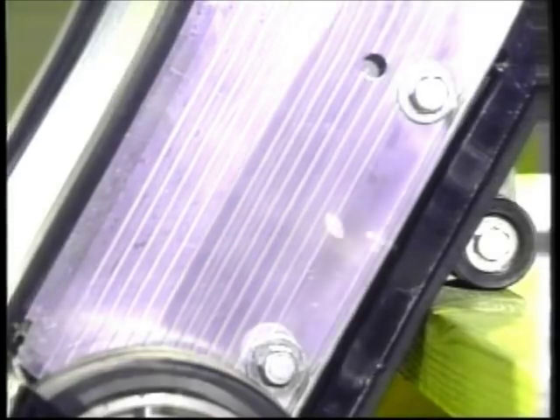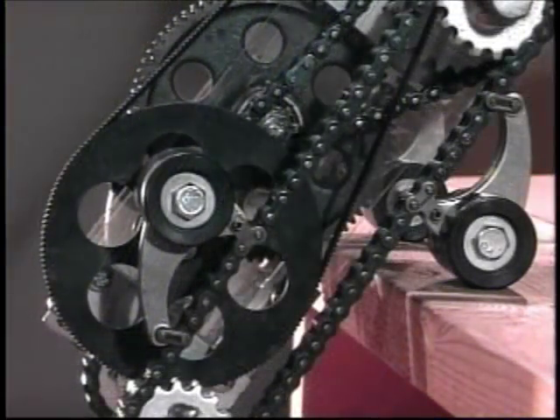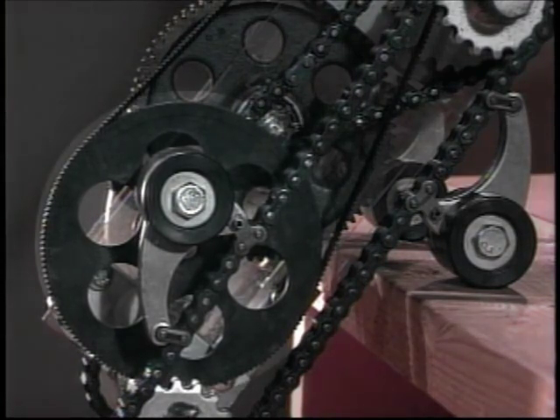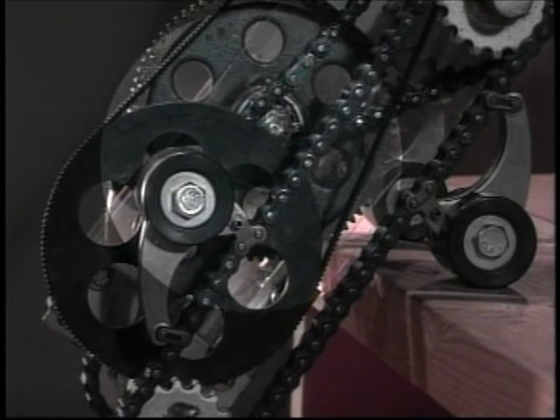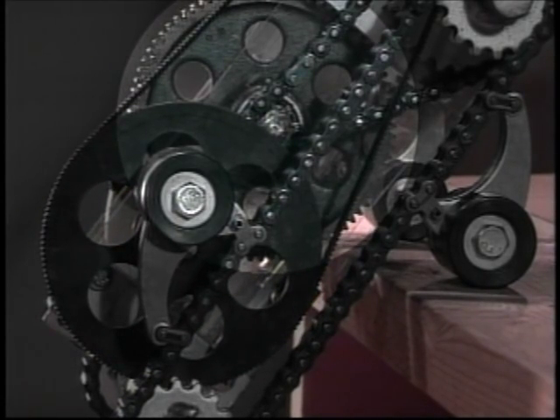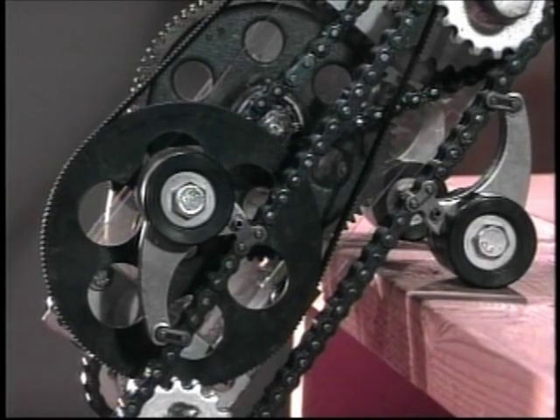This is the cutaway view. First we see the glide belt, the inside of the glide belt, and then the gearbox. The gearbox on the Escalera is very efficient. The first reduction is a six-inch pulley going to an 82-tooth spur gear and finally to a 27-tooth sprocket — a 200-to-1 gear ratio with only three reductions, beginning with a half-horsepower permanent magnet motor.